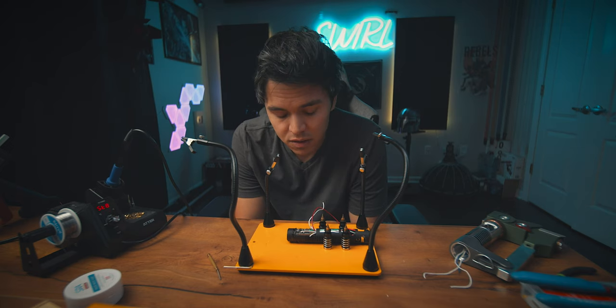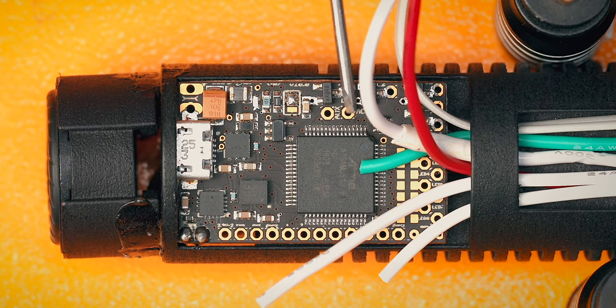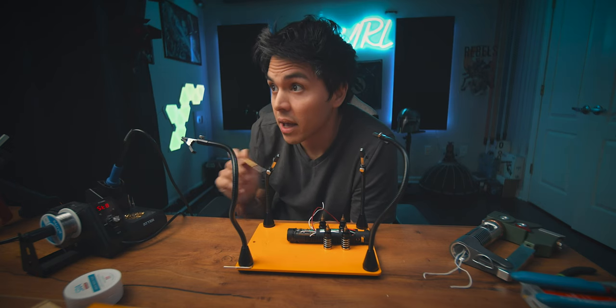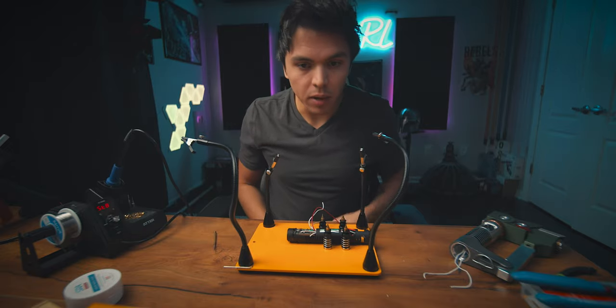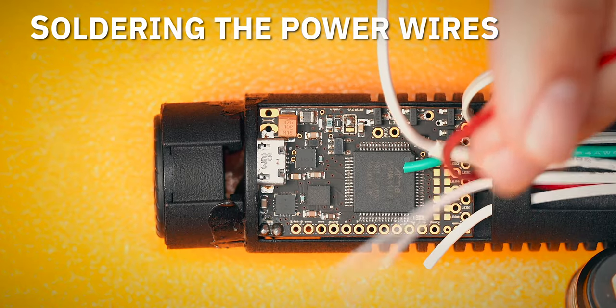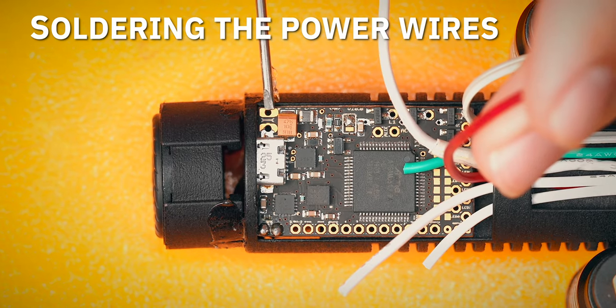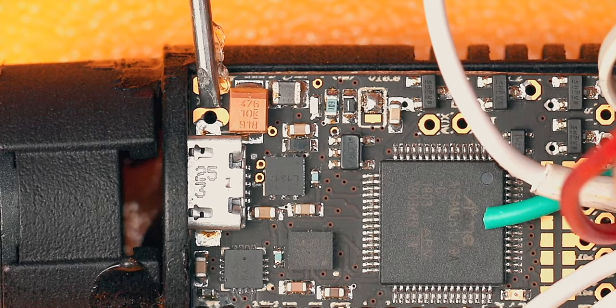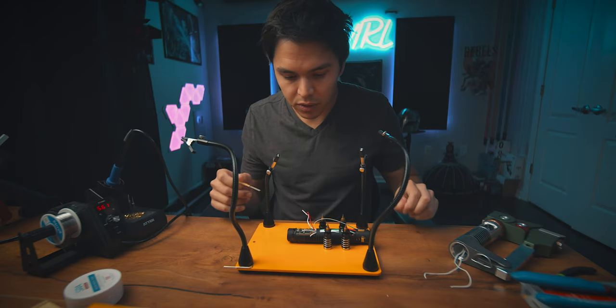Electricity — this is so frustrating. Activation goes there, auxiliary goes here on that one pad. The auxiliary also has two cables. I'm gonna do power. I think I'm just gonna solder to the power battery. The battery positive needs to go to that right there. The battery negative needs to go to the one right underneath it, so let's do that one first just so I have a little more space to work.